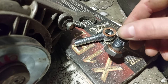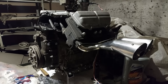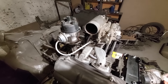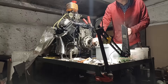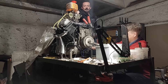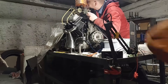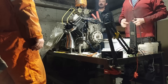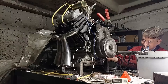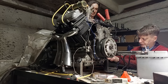Now let's try to start our engine and listen to our mufflers. First of all, I got rid of the oil heat sink – I'll put a bigger one later. Mufflers are already in place. The left set is put upside down to use the engine's starter; later there will be another starter in another place. I put on the ignition set and a carburetor. First attempts are a failure – almost no combustions are heard, there's even a tiny funny fire. I've mixed up the spark wires. After fixing this, the motor starts to make more sounds. The pressure lamp goes off when the starter is working, so the oil pump is okay. I adjusted the ignition a little...